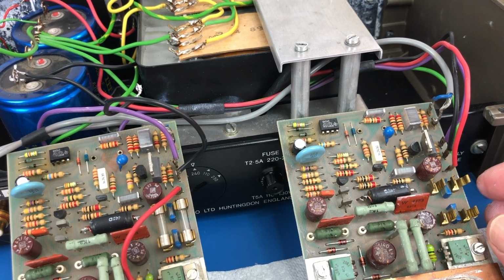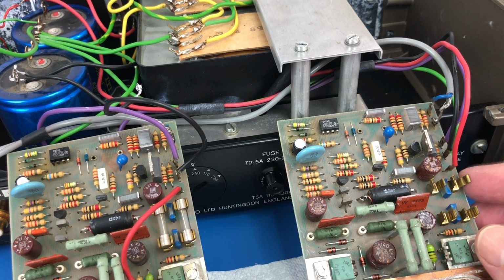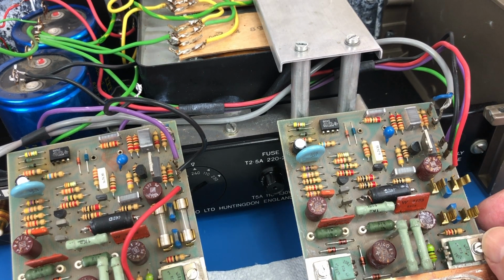I mean, given that it's got the fuses out, that indicates to me that it's blowing fuses, and again I haven't metered anything out with this or done any testing on this board at all. But I think I'd put money on that if I were to put the fuses in and turn it on, it'd just blow a set of fuses. So there's a few things there initially to be looked at, and then as I do some more poking around, who knows what else we'll find.